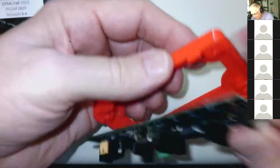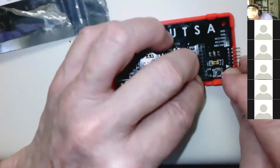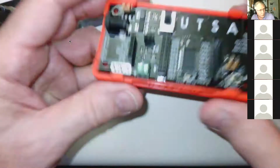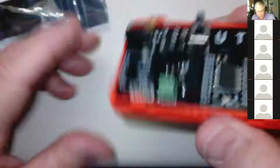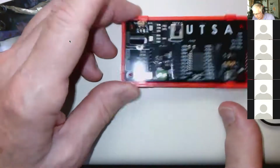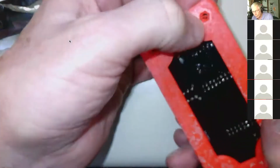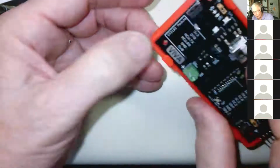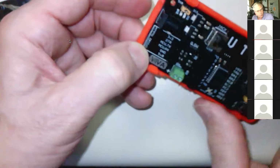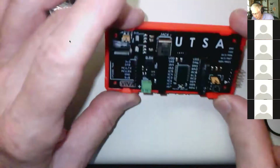Let's see. Yeah, takes a little bit. It's a pretty tight fit. It won't come out accidentally. Took a few printings to get these right. If you want, there is a provision to put an M3 bolt and nut. The nut fits perfectly in here and recesses. And if you get the right size M3 screw, then the nut will be pulled up flush in here and it won't stick out. But you don't need to do that because it's mounted very tightly this way.